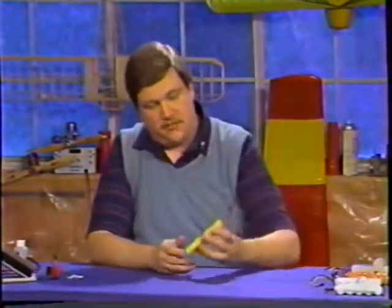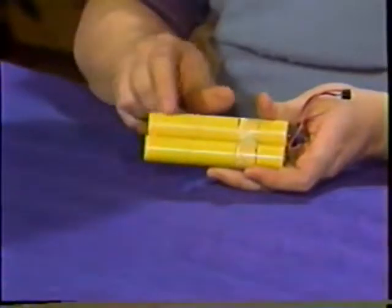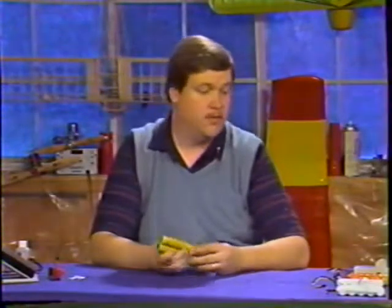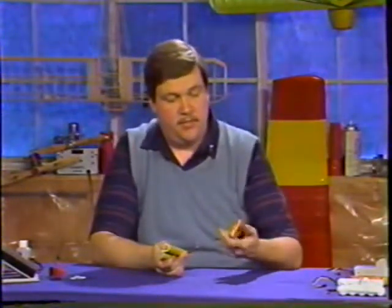You'll be dealing with two different sizes of batteries in electric flight. You'll be dealing with either 1200 milliamp cells, which are commonly called sub-Cs, and this is what you'll see in all the RC car packs that are around, or 800 milliamp cells. The 800 milliamp cells obviously have a smaller capacity than the 1200s, but they are substantially lighter. And the reason 800 milliamp cells have revolutionized electric flight is that a 7-cell pack of 800 mil cells weighs less than a 6-cell pack of 1200s.